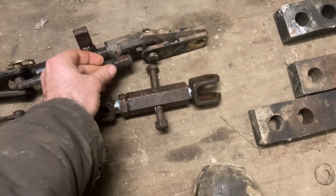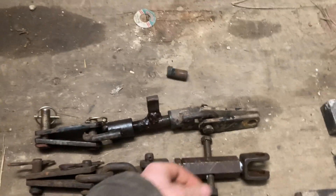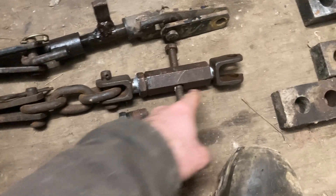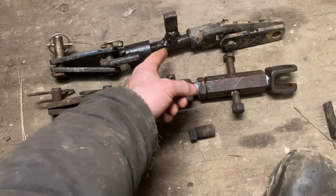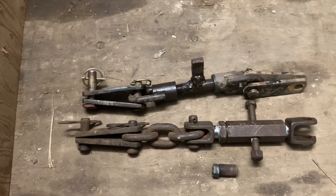About a week or so ago, I broke the linkage for the three-point hitch off on the threads. There's the chunk — it goes up in there. I welded it on enough to pull it out. Same wrecker, same deal — the 685 had this linkage. I don't know if this is picking up very good, but the threads going in and out of this body here are a lot heavier duty than this. This here is the 685, and this here is the 4230 — 80 horse vs 60 horse — and they've got a better linkage on the smaller tractor.